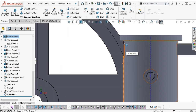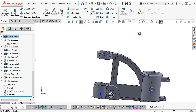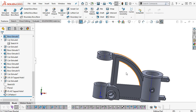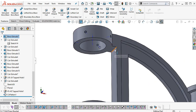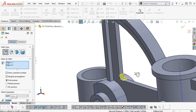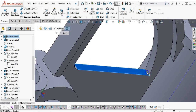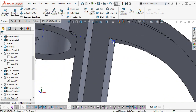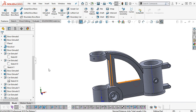I still have a couple concerns with that gap and the transition that I would want to clean up. The radiuses, let's put in just a couple, and I think this one's probably going to end up being a face radius anyway. So we have 0.25 and a 0.25, and we'll kind of combine those up. Alright, and then the insides. Okay, that one goes to 0.5.